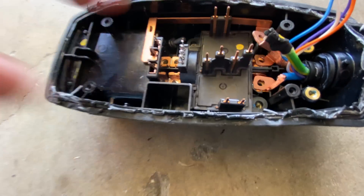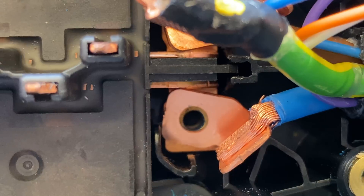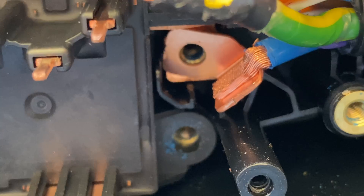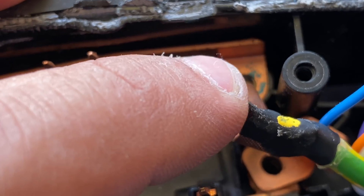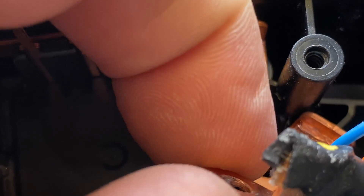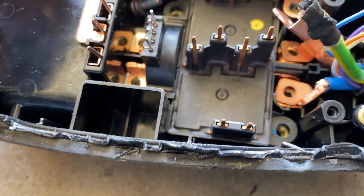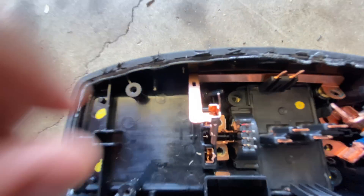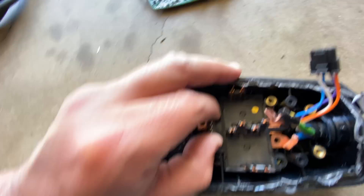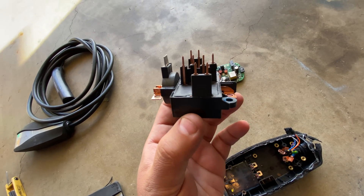Other things to notice: these terminations here are sonically welded — you can see that right there. Both of those connections are sonically welded onto those little plates. This other one uses a brushed-on coating instead of shrink tube because it's positioned higher and needed to be shielded. Then to remove the assembly, you just take a screwdriver — this is just a ground bus bar — and then you can pull all of this out, which is the relay assembly.